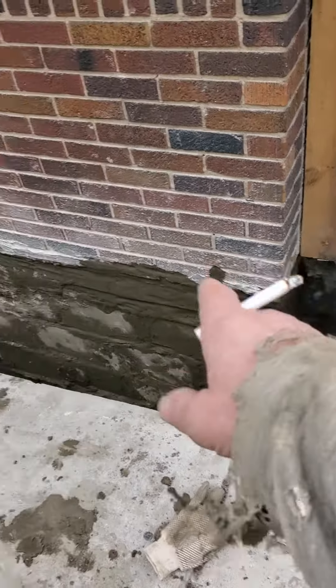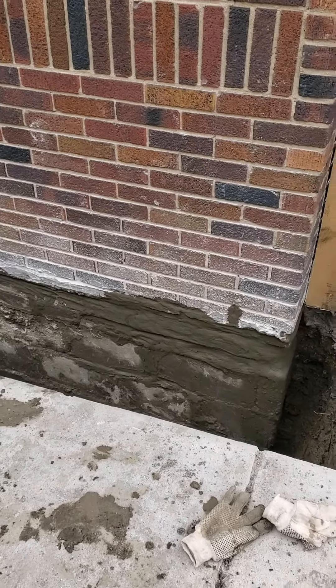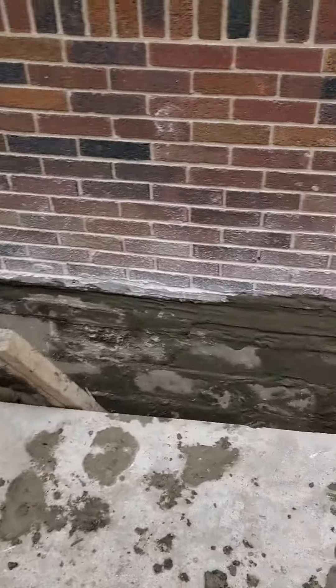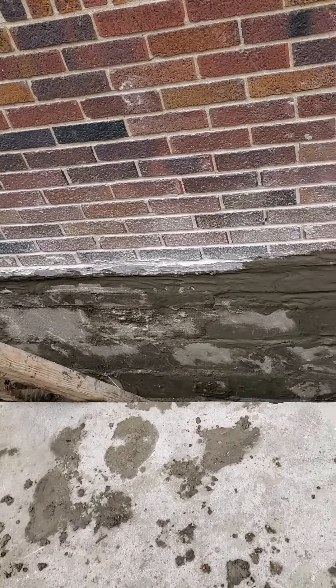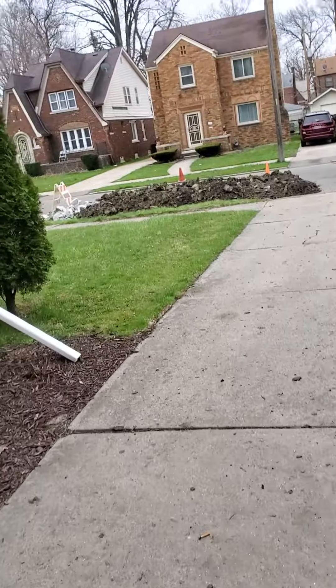This is the corner where the bricks — I think there were at least two missing right here. That's the prettiest I can make it. Now don't forget, you're going to get thick — thick mastic, a.k.a. tar, a.k.a. roofing cement — over all of this, top to bottom, end to end. And then visqueen over that, and then you're going to have all gravel.